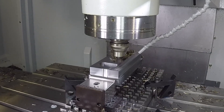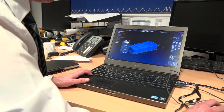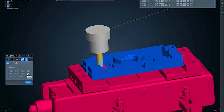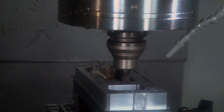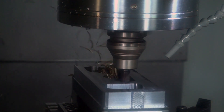Process reliability is constant because within Tebis they use a full simulation package — kinematics of the machine, collision checking of the part, tool changes, and accurate cycle time, all integrated with no third-party software. They can come on site, scan the machine, and build an accurate virtual representation of it. This is why cycle times from Tebis are accurate: they include tool changes and machine acceleration and deceleration, using standards taken directly from the machine tool vendor — unlike other CAM systems where the estimated cycle time often doesn't match reality.